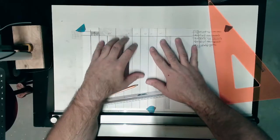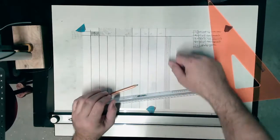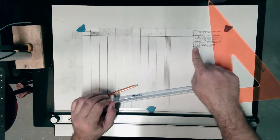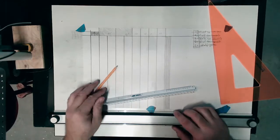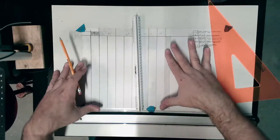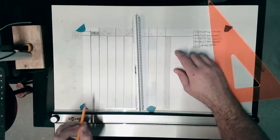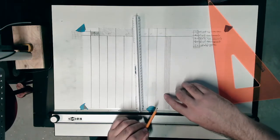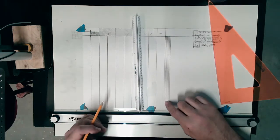All right. So, I'm going to assume that we're almost there. Last thing we did was put these little 1/8-inch lines that generated our 5 10-inch by 1/8-inch vertical lines. Okay. Last but not least, we're going to do a horizontal grid lines across our 10 by 10. Okay, so after we mark this, we're going to strike these lines, but I want you guys to be cautious. Do not come into these little lines over here, okay? We're going to strike from this first edge left. We're not going to come into these lines, okay?